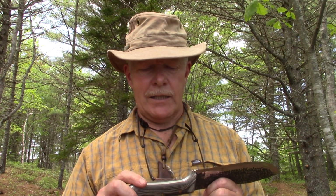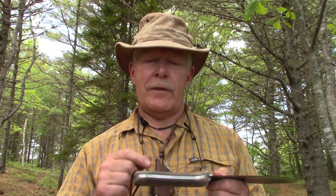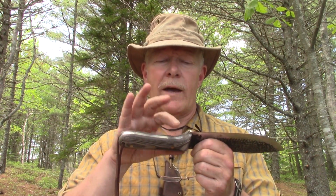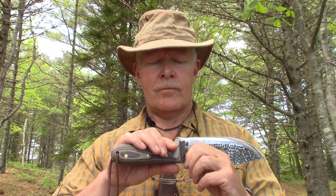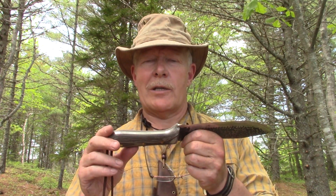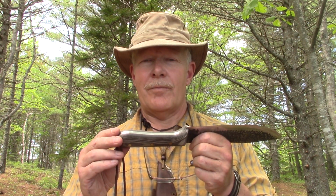It's a big knife, but can it be made to be an all-purpose knife? Well, I think I've done okay with it. What I've done is first, I ground off the pins with an angle grinder and took the hardwood scales off. Then very slowly, dipping it in water as I went, I moved the handle forward right up to the edge of the blade. Very, very little ricasso, virtually less than 1/4 inch ricasso left. That gave me at least 3/4 inch longer handle.